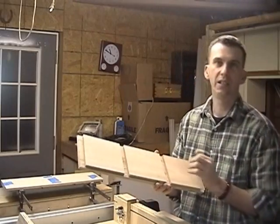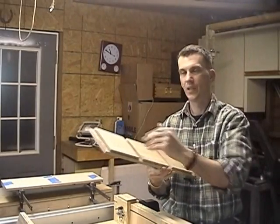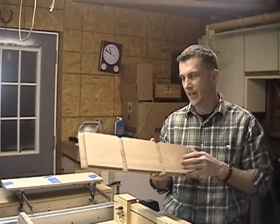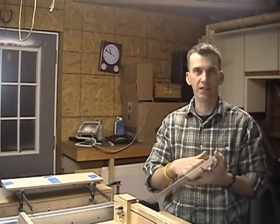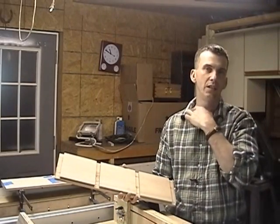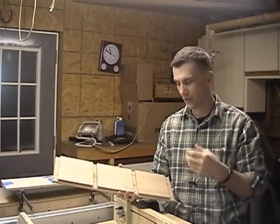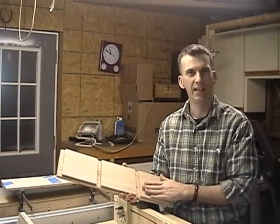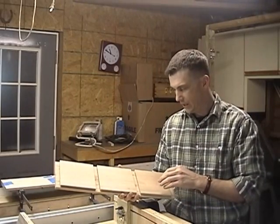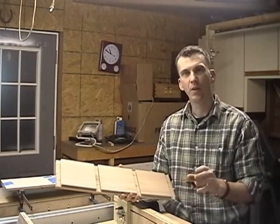And that's when you can make an option of pre-finishing the inside before you do the glue up. Now this is a small cabinet, and I'm using an oil base. It's a tung oil varnish to finish it off. And on the inside, if you're worried about the smell of oil or an odor on the inside of this cabinet, I haven't had any problem with that.